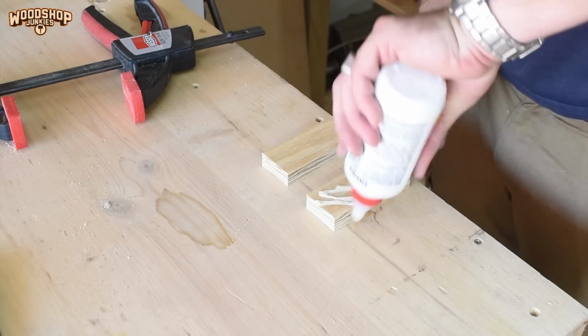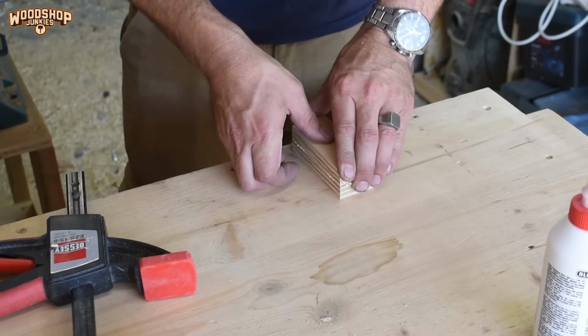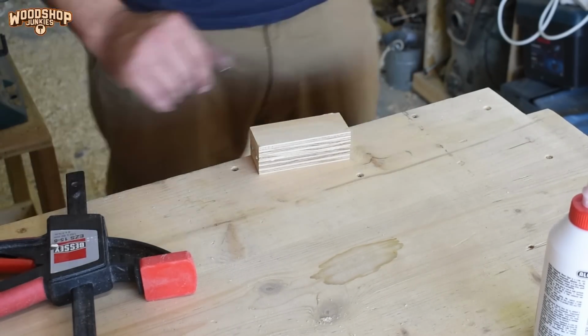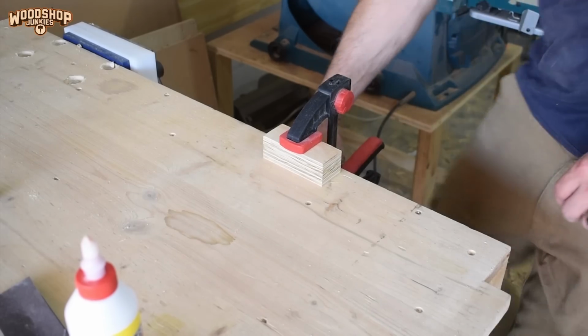For the handle arm, I'm going to be using a piece of 19mm or 3/4 inch aluminium round tubing, and to seat the tubing on the base I'm going to layer 2 pieces of plywood together and bore a hole that can accommodate the pipe.